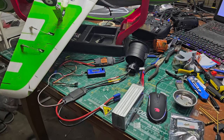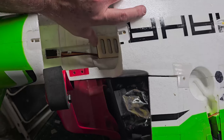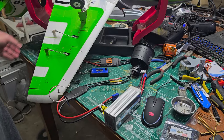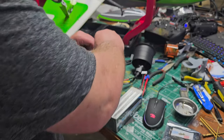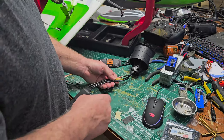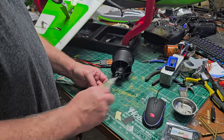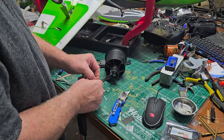We're back. I've worked the wood up enough to where I can easily slide things in and out. Now I'm going to hook up the new ESC — I'll need a battery and a servo tester standing by. Be careful with the safety tape around the connector: don't just cut it off aggressively, just slice off the tape carefully so you don't damage the insulation.